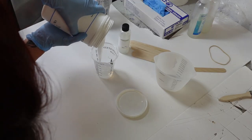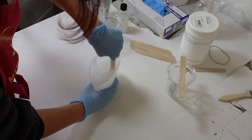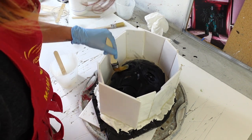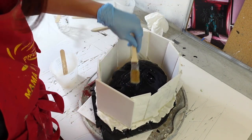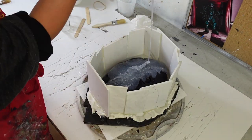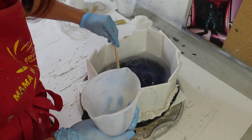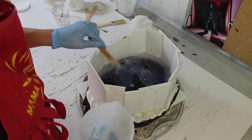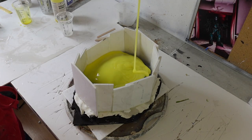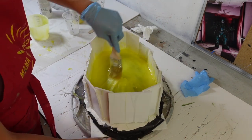I made this mould using silicone which comes in two parts that you mix together. First I brushed the silicone onto the mask, being sure to get it into every detail and crevice. I then poured the rest of the mixed silicone onto the mask to create the mould. Because of the mask's shape being so domed, I spent some time pushing silicone up from the sides and onto the top of the mask as it set. I also ended up using two different silicones to get enough coverage — they happened to be two different colours, but silicone will just stick to itself if you don't put any mould release on it and will all become one block once set.